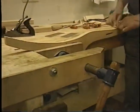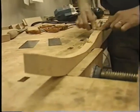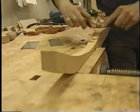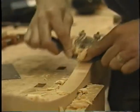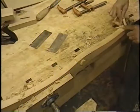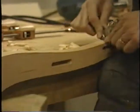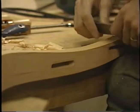Smooth the parts with anything you have available. Spokeshaves, scrapers, rasps, and hand planes may all come into play on different parts of a curve. The spokeshave smooths the bandsaw marks well, but with its short sole, it doesn't always even out the bigger bumps. If you skew the tool a little, you lengthen the sole with respect to the work, and it's easier to plane away irregularities. Pay attention to grain direction, or you'll see lots of tear out.